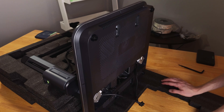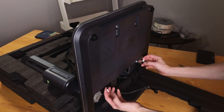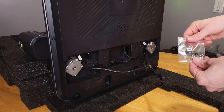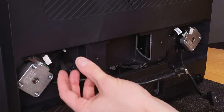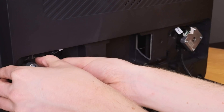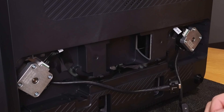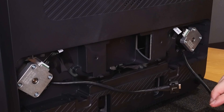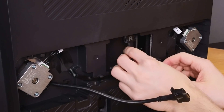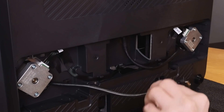Now that we have the screws installed, there are just a few cables we need to attach — these two here, and also these two little white ones that go into the metal plates. For this part we need the M2.5 screws. First we're going to take these white cables and plug them into the slots on the back of these motors on both sides. They'll only go in one way — they've got little grooves to make sure of that. Next we have these USB cables, which is interesting to see USB-C inside a machine for cabling.